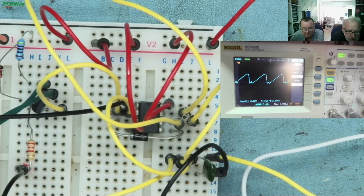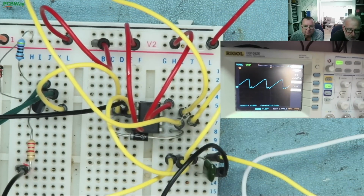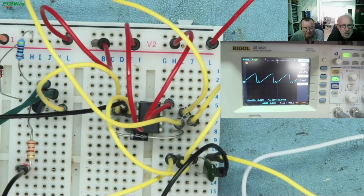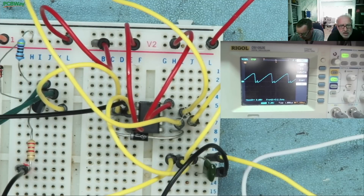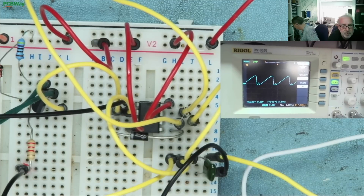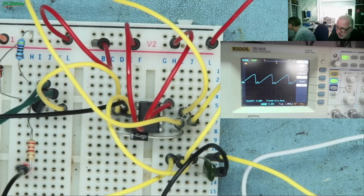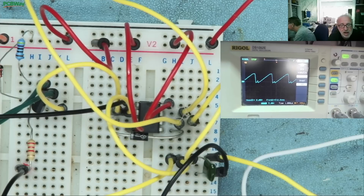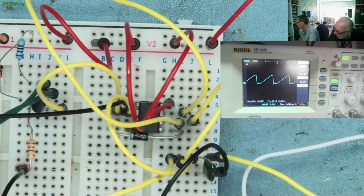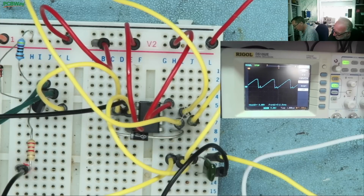You know the socket down there in the lower part, this thing? There's a diode in there, right? Yeah. This is a silicon diode? Yeah, 1N4007. Can we try a Schottky? If I can get my hands on a Schottky, we certainly can. Do you think that'll actually deal with that? This could be the thing. I don't want to have this, the socket down there. Schottky, is it 1N5819 or something? Yeah, will work.